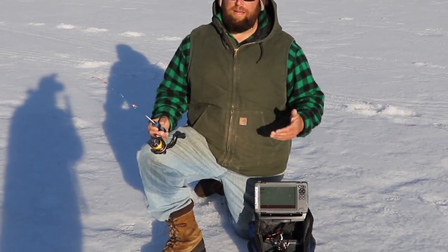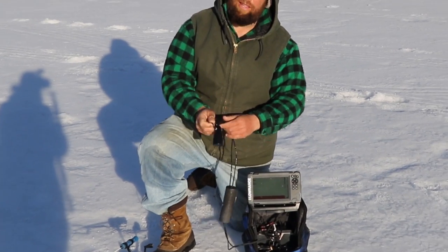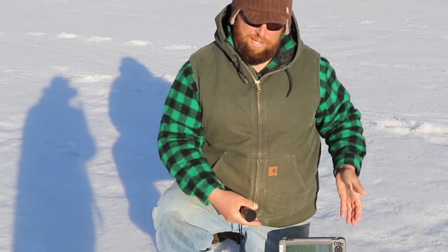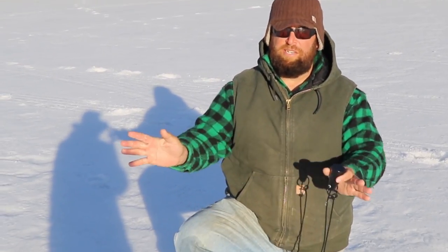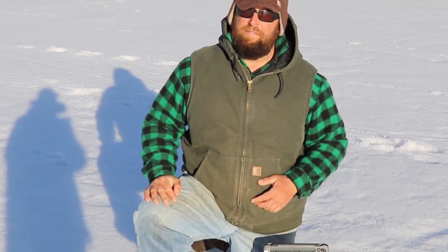Try to get your transducer as flat as you can laying in the water — you don't want it off to the side. This is a Lowrance transducer made for ice fishing. When I put this unit on my boat, I'll have a regular skimmer-style transducer. The biggest difference is this ice transducer is pretty heavy, so it lays down in the ice hole, but it shoots a much narrower cone than the bigger one does. The skimmer is going to shoot a much wider cone. When you're ice fishing, you just want to see what's going on right underneath you. I put it down as low as I can below the hole so I'm not getting any interference from the ice. If the ice isn't too thick and I can get it below the hole, I get a lot better view of what's going on down there.